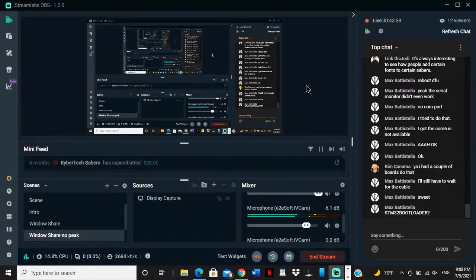Press boot and reset until it resets. Plug it in with a proper cord. Press upload. Don't worry about selecting the port. That is the actual procedure for rescuing a board that had an interrupted upload. That's the actual prescribed procedure for doing that in the manual. Yeah, but you shouldn't have to select that in the ports, Max. Just hit upload, and it should work.